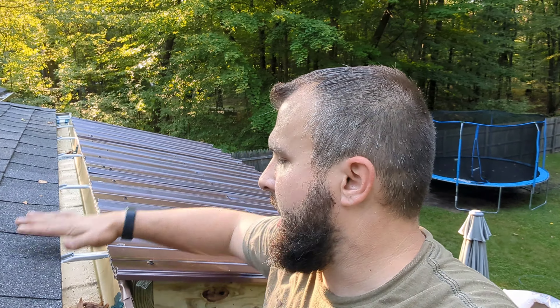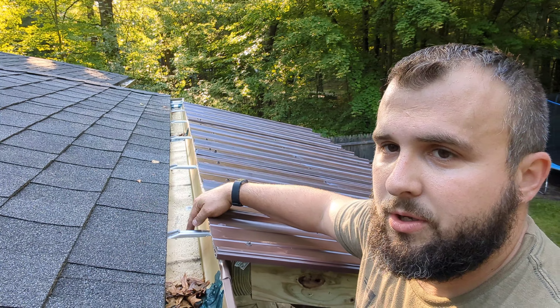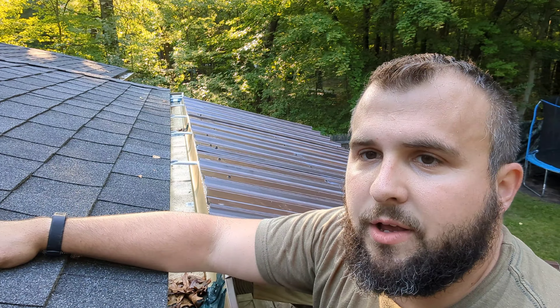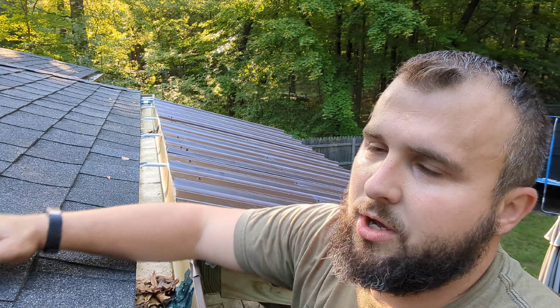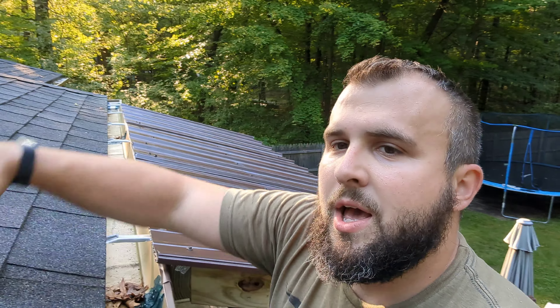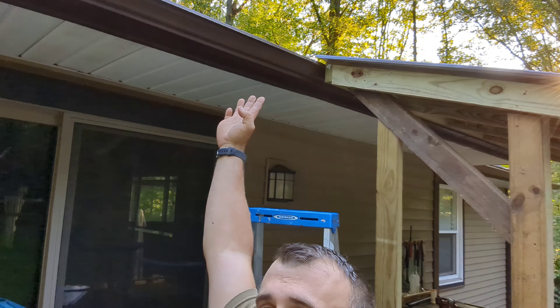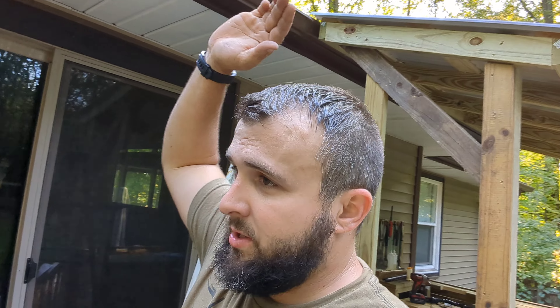In case you're wondering why I didn't just run this under or over the main roof — I added gutters recently so that water off the main roof comes in there, and this new roof will act as a diversion for water without having to butt the two up together. I was afraid that if I put this roof over the shingles it would discolor them, and when I had to redo the roof it would be difficult. It also couldn't go underneath because that would make the clearance so low I wouldn't feel safe with the grill. Now that the roof is done you might think we're done — no. I want it to look seamless, so I'm going to add brown aluminum fascia around it to match the rest of the house under the gutters for a seamless transition.